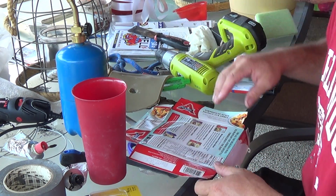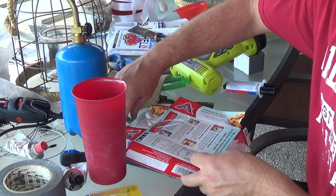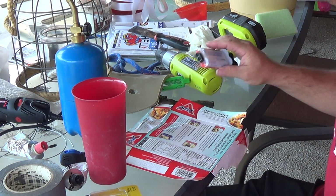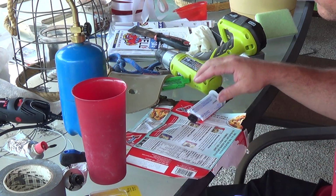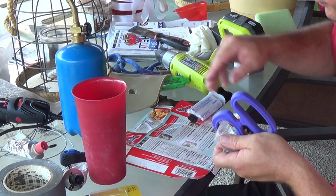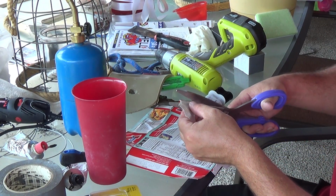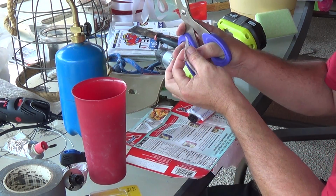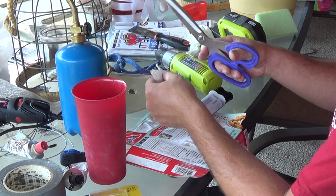First off, on the fiberglass that you're using, I found that fiberglass can be a pretty darn good filler for the epoxy, because this epoxy is not reinforced. It's going to be really nice, strong, durable, but having some fibers in it will create a lot more strength for you. So you can use your fiberglass to create what's called filler. I'm going to cut the ends of this off because this is fiberglass tape, and I don't want this big long strand in my mix.